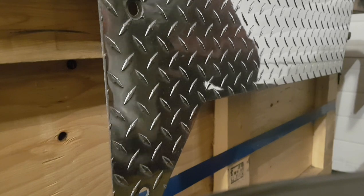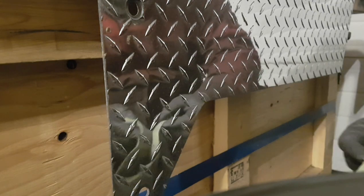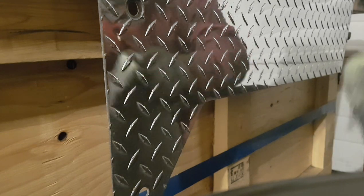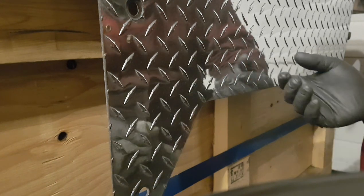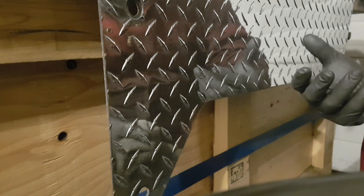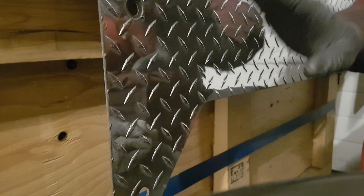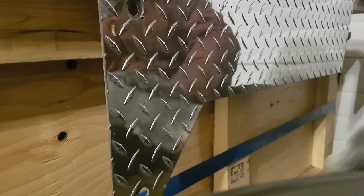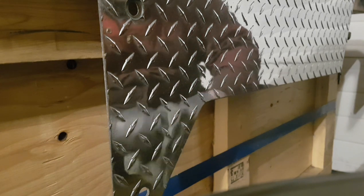So what we want to do is take some gun wash. Your paint thinner will work. It's just you'd have to have two rags, and the reason the gun wash works so quick is because it evaporates. It does the same thing as thinner in theory, but the gun wash evaporates a lot quicker, whereas with thinner you're always trying to get your smears out. Anyhow, what we do now is take some gun wash